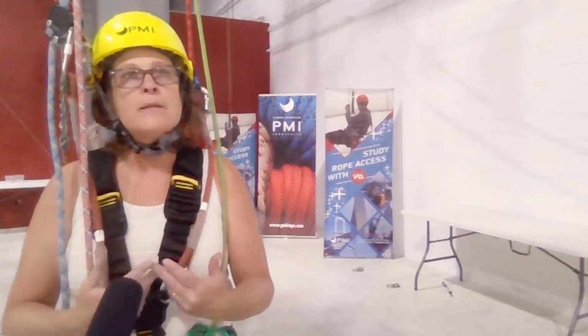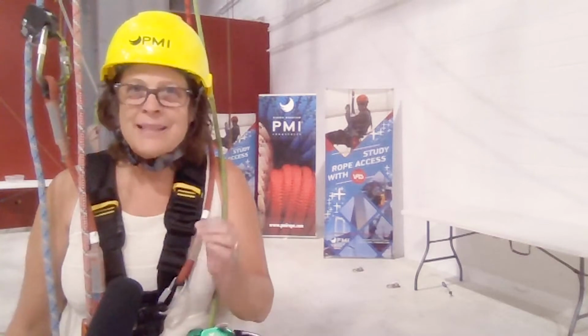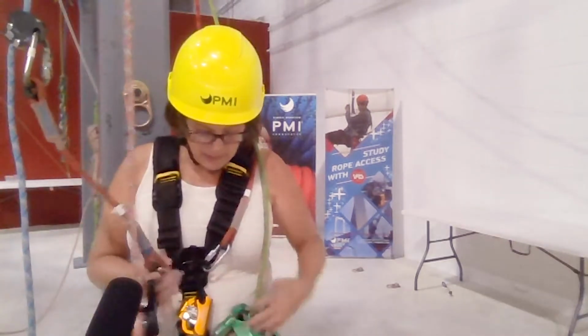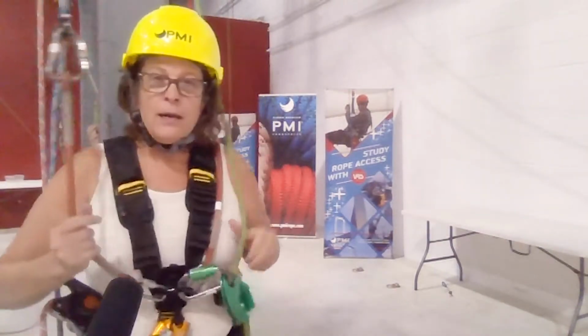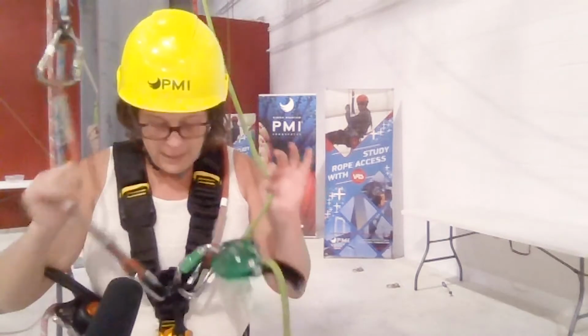So let's clarify redundancy. Redundancy can essentially be defined as the idea that the failure of any one point will not result in catastrophic failure. I'm going to repeat that. Redundancy can essentially be defined as the idea that the failure of any one point will not result in catastrophic failure. But here, when you have both your primary and, in this case, I would be connecting my other system. In fact, let's just attach my progress system to my backup system. Now, if both of these were loaded at the same time, I would be in violation of OSHA regulation, because if they were loaded at the same time, failure of this point could conceivably result in catastrophic failure.